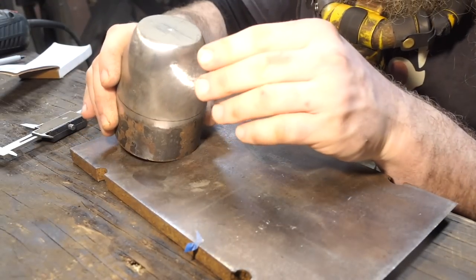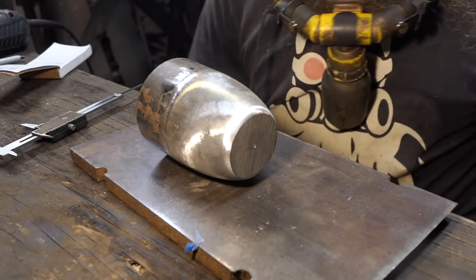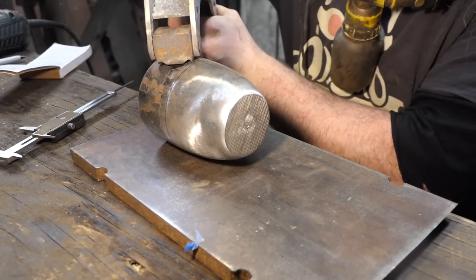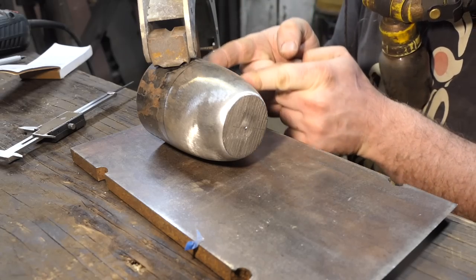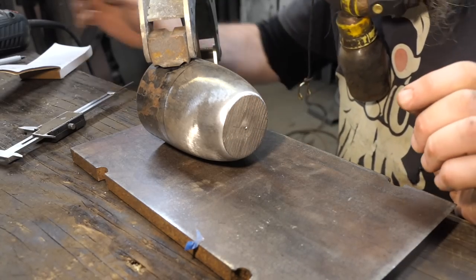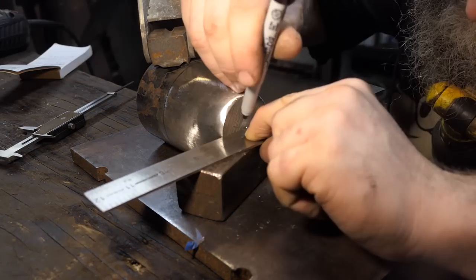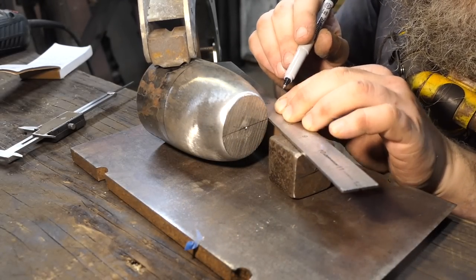What I'm doing here is trying to get a center line drawn all along the edge here. There's some gadget — I can't remember what it's called — that machinists use, that would make this easy peasy. But instead I'm doing it the usual way with far too much hardship. Step one is I want this clamped down tight. This section back here is still a true cylinder, but this is all angle-ground nonsense, so this point should be floating in a kind of center-point location. The center point was the very scientific measurement of this inch and a half plus this ruler that was slightly less than an eighth.